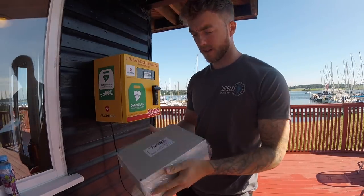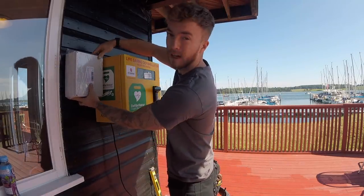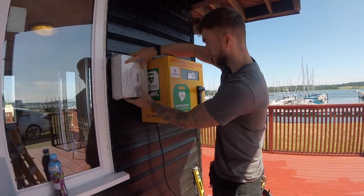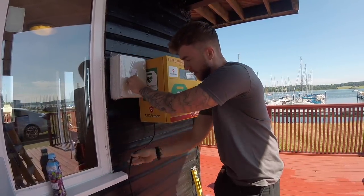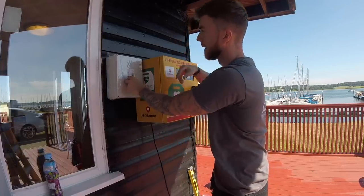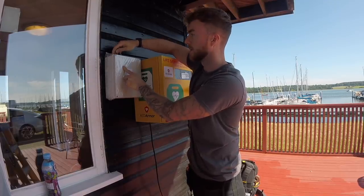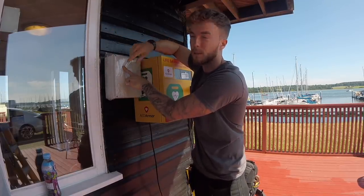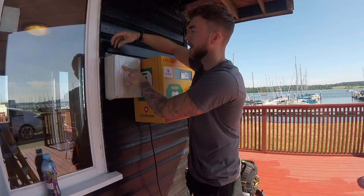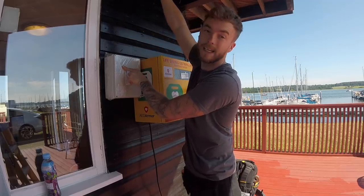Now unwrapping the adaptable box - I'm going to mount it in line with the top of the defibrillator unit, which I think is the most aesthetic position. I'm putting a stuffing gland in the bottom for the flexible cable to come up and clip to the cladding. I'm going to bring the SWA into the top of this box - normally I'd bring it in the bottom but because it's sheltered above here I'm not overly concerned about water ingress at the top.